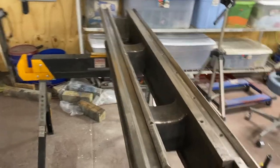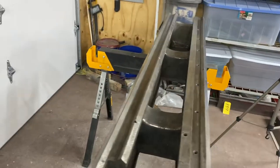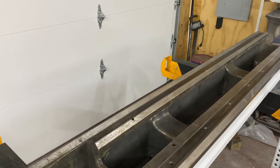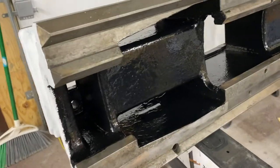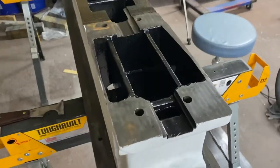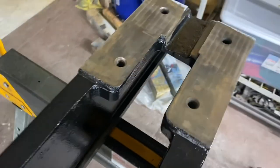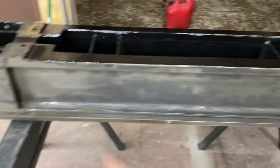I think that looks good — you can see the brush marks. Got that flipped on its face. As I was painting some of the Bondo right where I had been very thin, it kind of lifted off the metal, so I just put on some extra thick paint. I'm going to try to see if I can sand that flat or whether I'm going to have to go back, put more Bondo in it. Right now I've got some black — I'm just going to put some black gloss on the inside parts. I'm not going to try to smooth them out; I'll just leave that as a rough unfinished surface. That black in there looks good. I think that's going to look very nice.